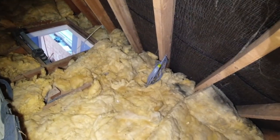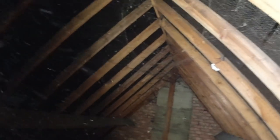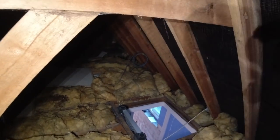Let's grab my torch. I've already wired up a smoke alarm feed, which is there. That'll coil up, that'll go up the rafter. So I don't know what the loft guys are doing with these rafters. That'll go up into the new hallway of the stairs for an optical. And then we've wired up one fan.